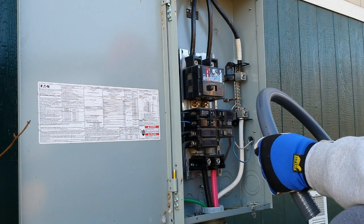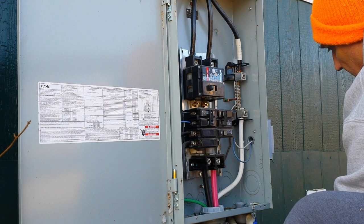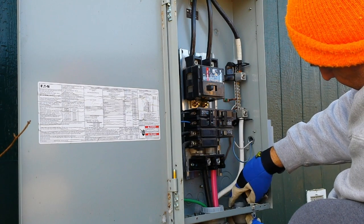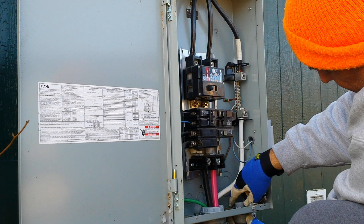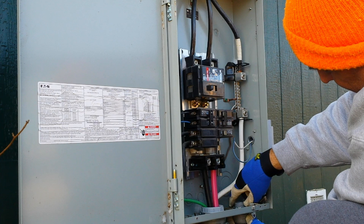I'm pausing right here because I had some camera issues, so I'll walk you through real quick. It actually jumps to me being finished and doing a walk-through, because I didn't realize it until I was pretty much done and had the cover back on. Doing this in the summertime would be a lot better — it was only like 20 to 25 degrees. So flexible conduit and 8 gauge wire — not very flexible. Just using these watertight compression style fittings so you don't have to use any glue. Then just went out the bottom and around to the back pole. You didn't miss much, it was just a little bit of a chore since it was so cold.